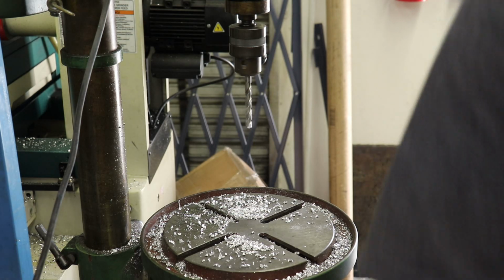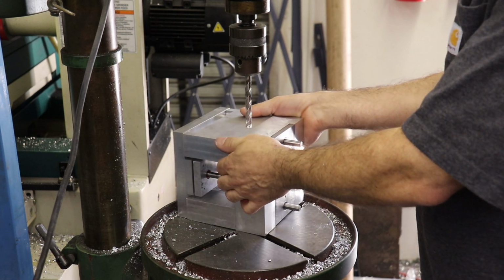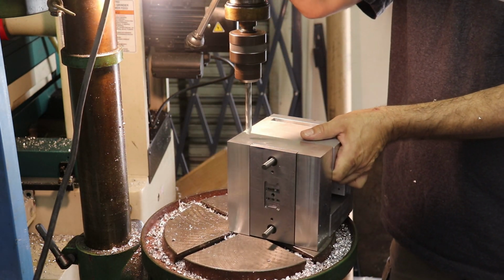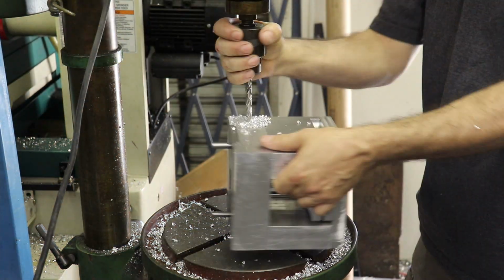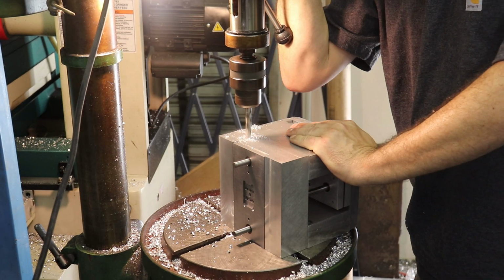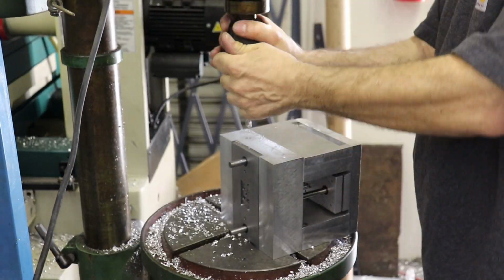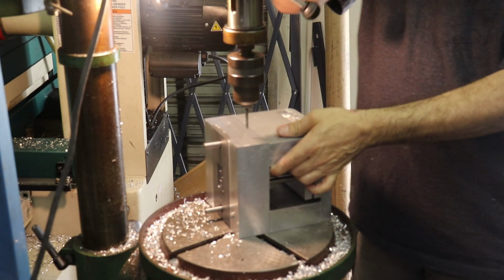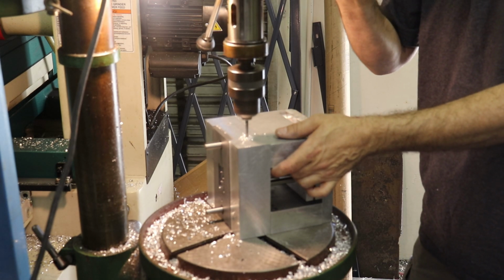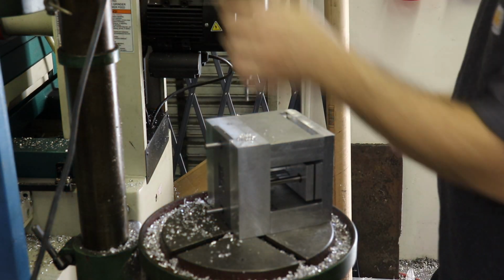Okay, let me get the other mold half. Okay, here's the other side. Same process, making sure not to drill into anything important. So we'll put this temperature sensor spot basically symmetric on the other side of the block. About that deep. It's about 1/2 inch deep.